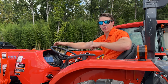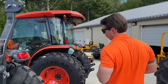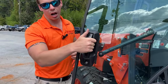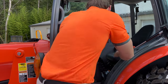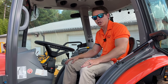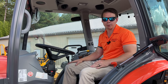I'm going to quickly show you guys the inside of the cab tractor. If you've got a cab, you can see the differences, but as far as function, service intervals, and fluids, all that will be the same — same loader, same tires, same axles, same fluids. On a hydrostat, you do want to use Kubota hydraulic fluid, which is going to be the Super UDT — you have to use that with a Kubota hydrostatic tractor. On a gear drive, regular transmission fluid is perfectly fine.